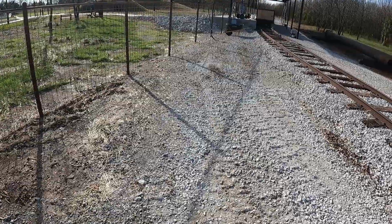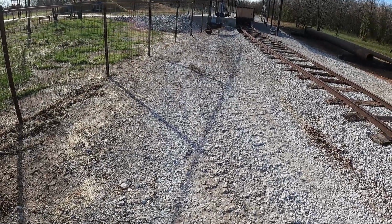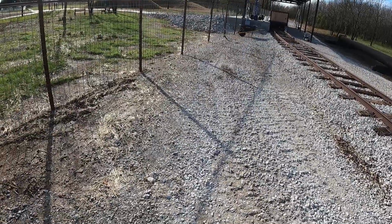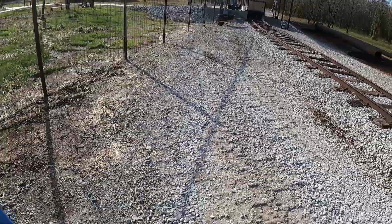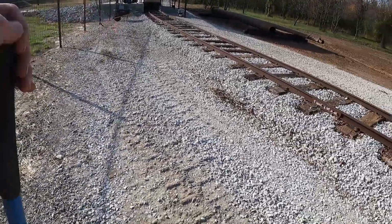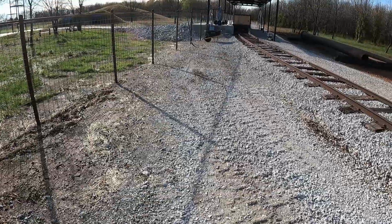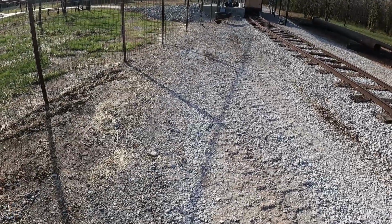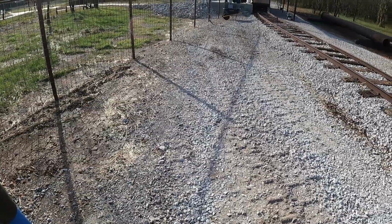It was supposed to take about 8 yards, I guess. But I thought he said it was 11 feet deep and a 5-foot circle, or I may just end up digging somewhat of a circle or square. I'll probably bring the 2150 back where I can just dig it and either load it into the truck or reach over there far enough to throw the stuff out, and then we'll just have to get a bunch of rebar. I don't know what size that's going to have to be. Built kind of like a little basket in there, and then fill the thing up with concrete.